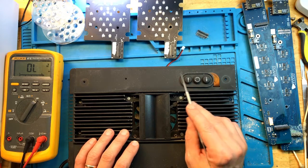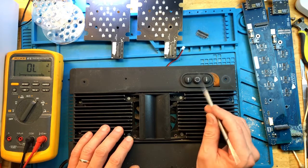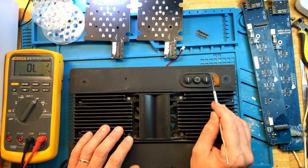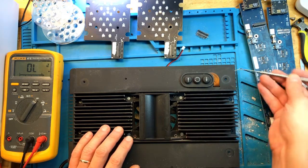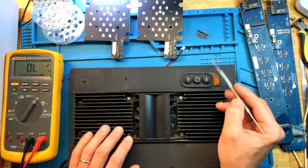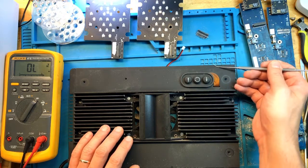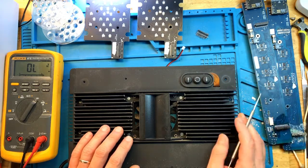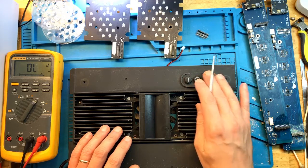Because the only opening at the top when you have the lid on is through these buttons. But this rubber seal is supposed to be tight against the lid, and it's not supposed to let the water seep through. The water is supposed to just accumulate here. The other option is that it entered from the side under the lid, because there is an opening here. Say, for instance, if the light was next to the wall of some kind, and the water was dripping down the wall, it got in contact with the side wall of this and just got onto the surface. But it eventually made it through this opening here, and that's what the issue is.